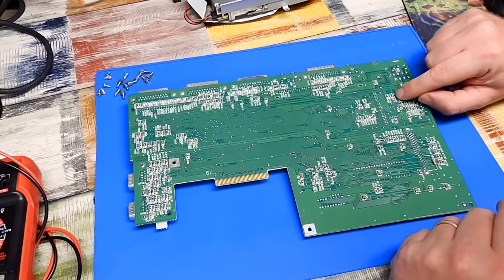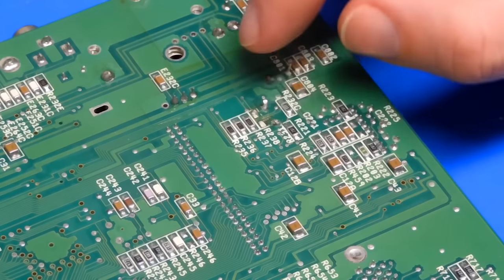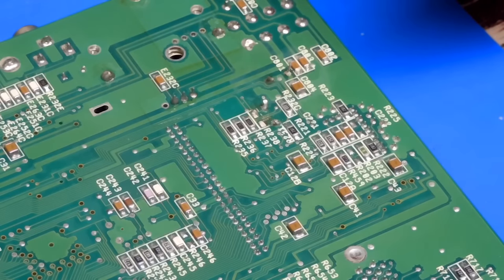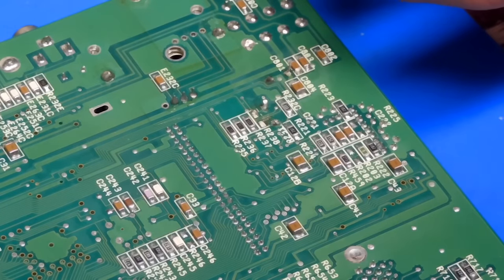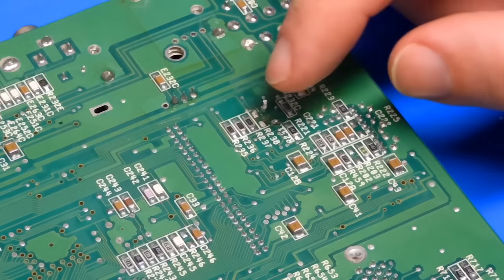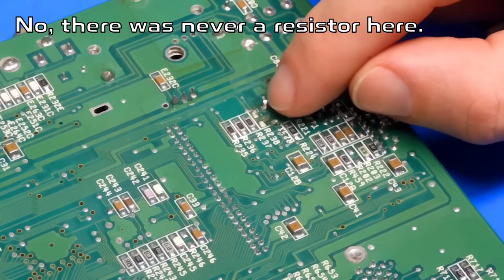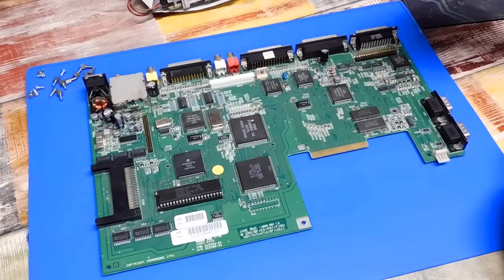Is that something else damaged there as well? Just beside those points where Christian has tried to replace one of the through-hole caps, resistor R238. It almost looks as if there was something there that's maybe been knocked off. Although there are various spots about the board where there are no components fitted. There are pads for components, but none fitted. So I can't say for sure. I'll have to double check that on the PCB Explorer. But let's take off what we can.